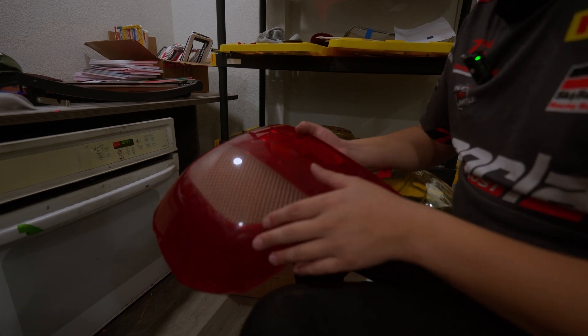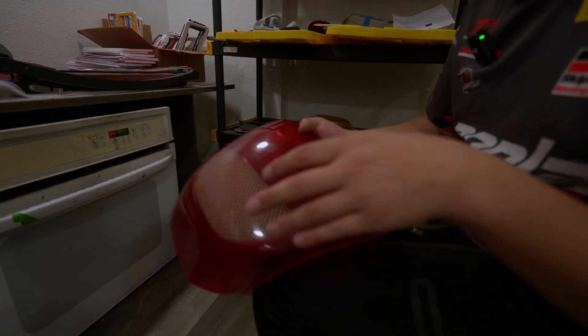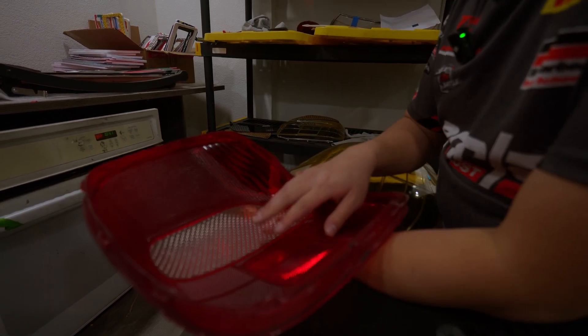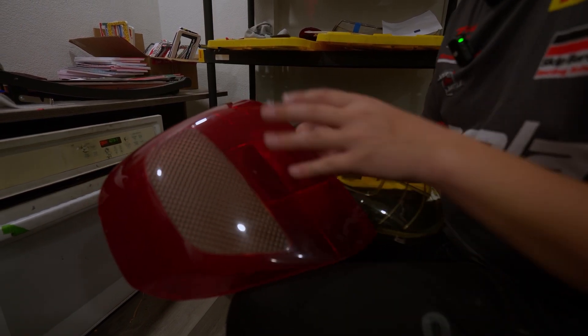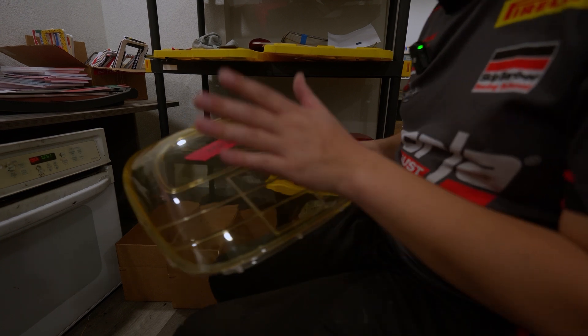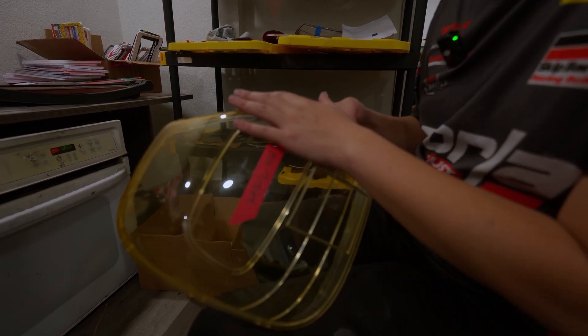You're always going to remember these panels have a little bit of elastic memory. So you have to overbend a little bit. You may want to use the inside if you can — otherwise the outside will work, but the outside doesn't bend as well. In this particular case, I have these 3D printed clear lenses for the MR2 that we use as molds because they've yellowed a little bit from testing.